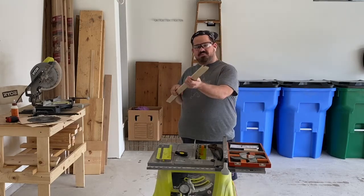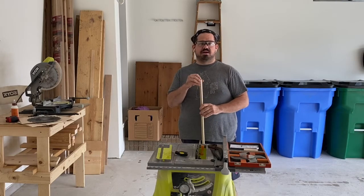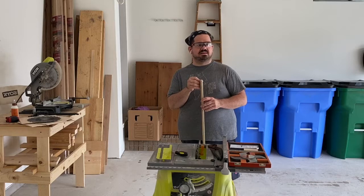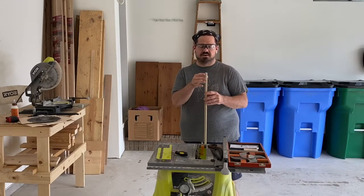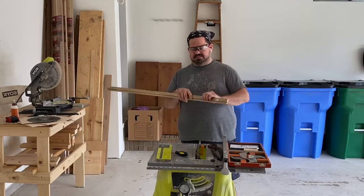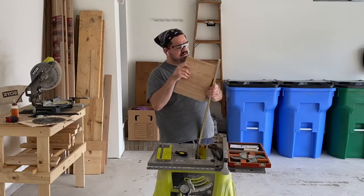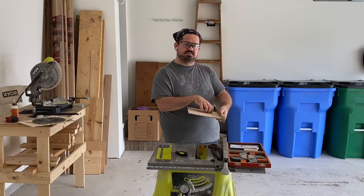And I went ahead and I cut a channel down a little bit over a 1/4 inch. It's more like, oh gosh, I don't even know how to explain it. It's just the slightest bit. It's like a 1/16 of an inch over a 1/4 inch, so that it sets in ever so slightly more. I set that so that the boards that I cut will sit neatly inside of the channel and create a really stable base for these to sit on.